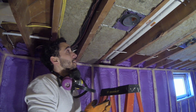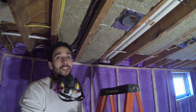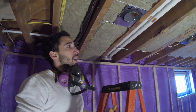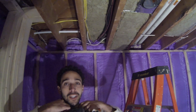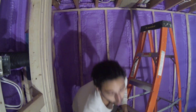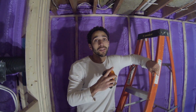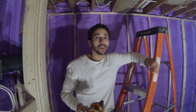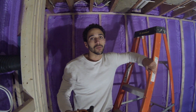As you can see this is an easy DIY project that anyone can do. One more final thing I want to mention is if you're just doing this for your own recreational basement, it's up to you — you could decide whether you want to use one or two layers of rock wool insulation. The difference in STC rating is 47 with one layer and 50 with two layers, so you have to decide if getting that extra three or four points is worth it or if you want to spend that money elsewhere.